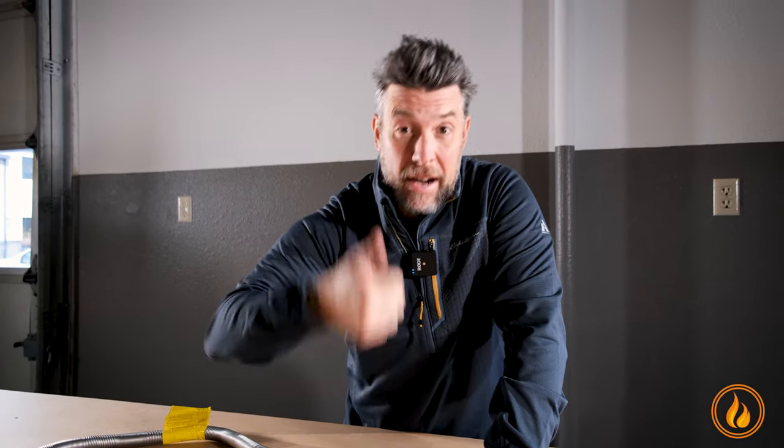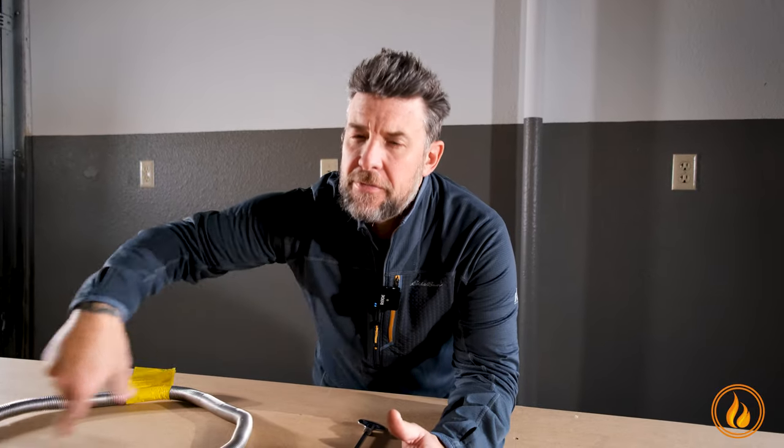kit. Dual flex line kits, important to know, is for burner systems for 250,000 BTUs and higher. The purpose for the dual flex line kit is to get as much fuel delivered to the burner as possible. So that's the reason. Another thing to make note of is that you're gonna need a little bit of clear space, a little bit of real estate underneath the burner plate within your fire feature, because you have a fair bit of plumbing going on, so just be aware of that.